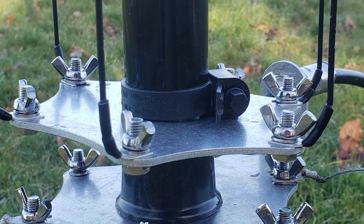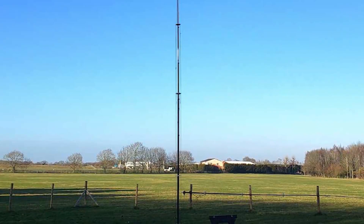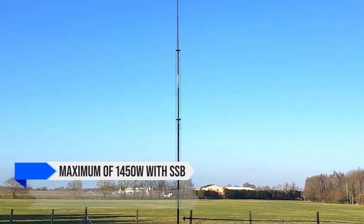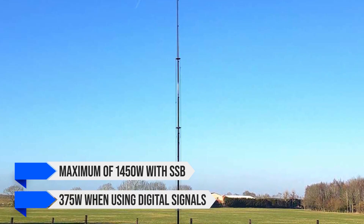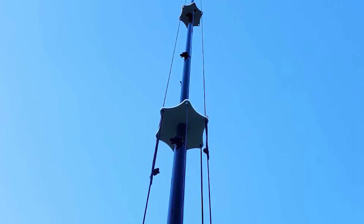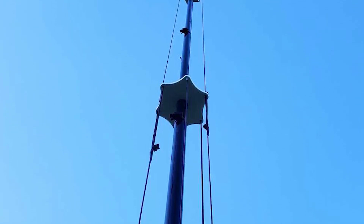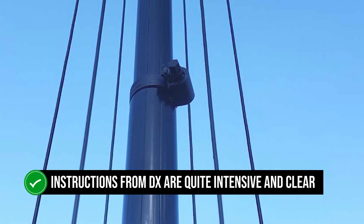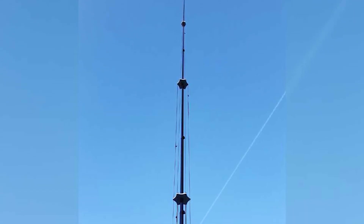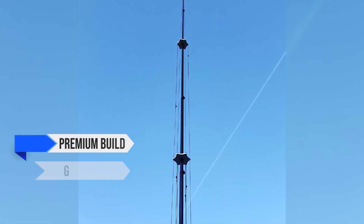Apart from the good signal quality and SWR, the antenna also lends itself well to power — it can go to a maximum of 1450 watts with SSB or 375 watts when using digital signals. The multiple-band resonant antenna comes with most necessities for a successful installation. It doesn't include an UnUn, but that's not a big issue. Instructions from DX are quite intensive and clear, which makes setting up the antenna easier, though some experience with vertical antennas is useful. Overall, the DX Commander Signature 9 is an excellent antenna with premium build and great features.